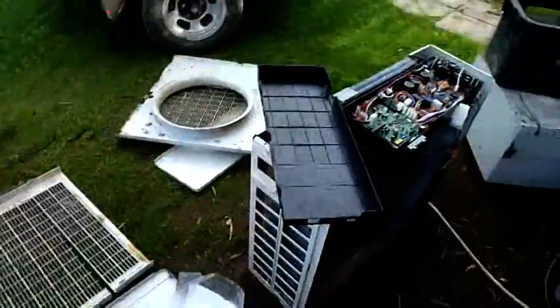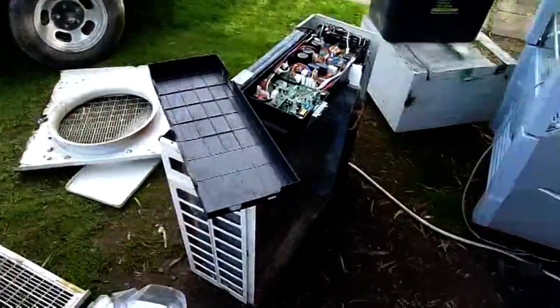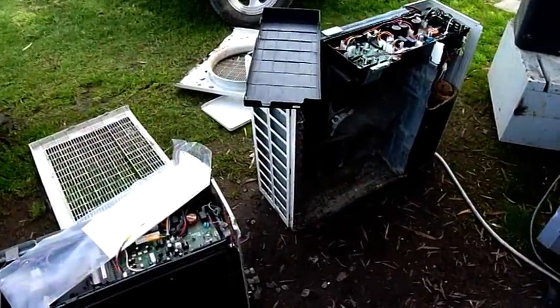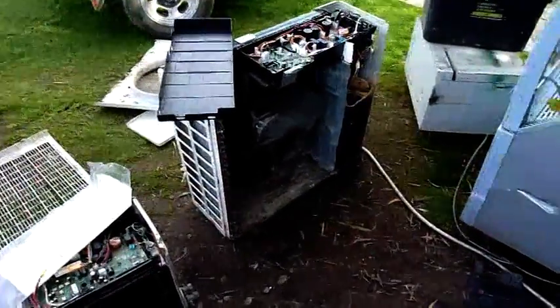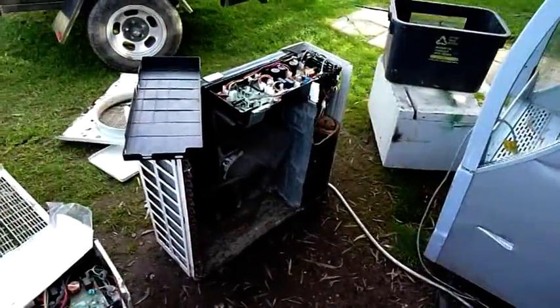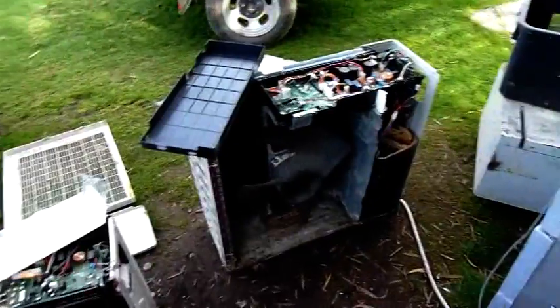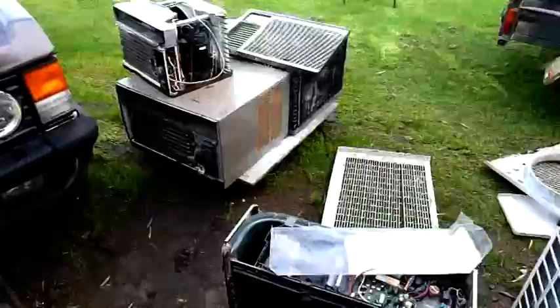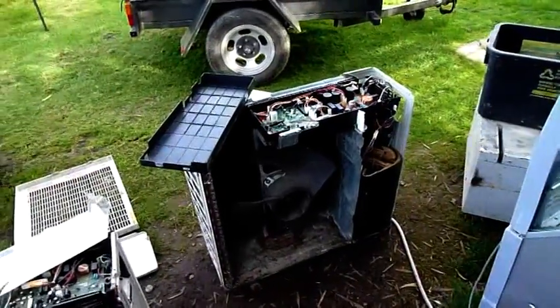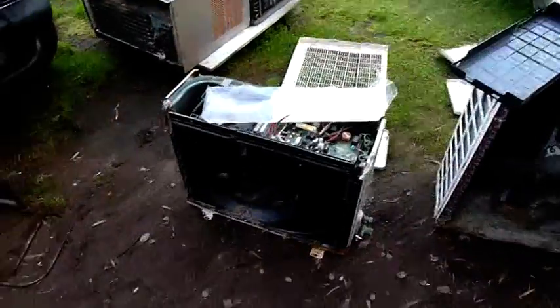I hope this gives you some info on inverters and a good lesson: never ever install one in an aggressive environment like by the sea. Wherever there's salt air, other nastiness, or airborne material — don't do it. If it's a nice dry climate most of the year, fine, but in a warm, hot, humid, and sometimes salty environment, forget about it. It'll be dead within four or five years. These ones here lasted nine or ten years which is pretty reasonable, but for a three-thousand-dollar air conditioning system I'd want more than eight or nine years — considering a lot of these old window shakers lasted 30 to 40 years. There are still air conditioners around that are at least 30 years old. They're just going to have to build them simple again. Forget about this economy money-saving inverter crap, because it's not money-saving and it's not saving the environment either. Thanks for watching.